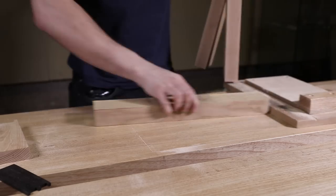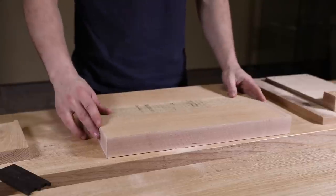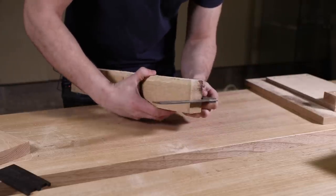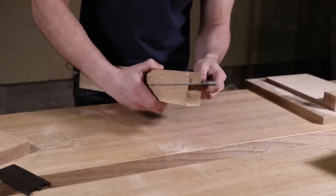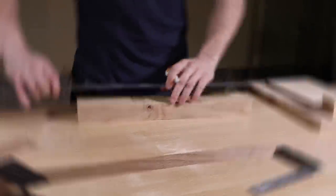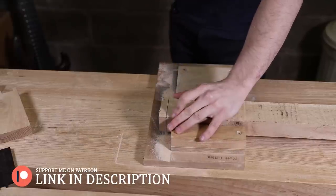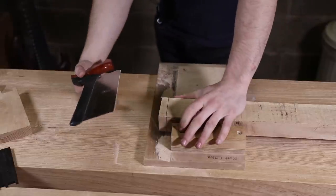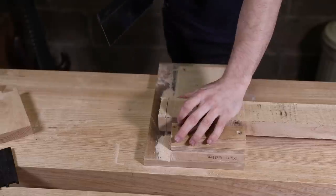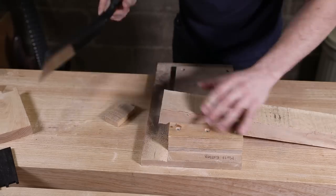Oak in the middle, beech either side — you can get a rough idea of how big this chopping board is going to be. We need to reduce the thickness a bit. The only thing we need to do now is cut the oak down to match the length of these bits of beech. I'll work out which end of this oak is the most square — that one's looking a bit ropey so we'll cut that end off. So we said 430 millimeters: square it around the top, nibble away at the back, lower the saw down and then hit the entire line perfectly square across its length.